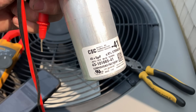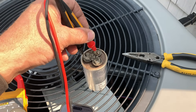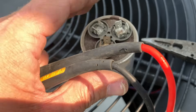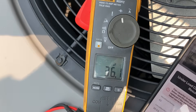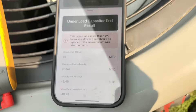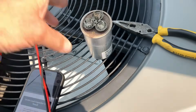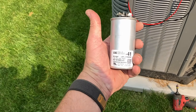According to the HVAC School app this capacitor was bad — it's a 45 over 5 dual capacitor. Let's go from herm to common. There's a lot of rust; we have to clean up a little spot. Reading: 36.1 microfarads — and it was reading 36.54 while it was running. Let's also go common to fan just to see: reads 5 — so the herm side is bad, the fan side is still good. Capacitor flip — nailed it.